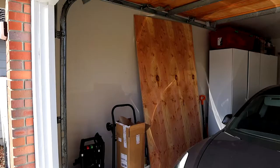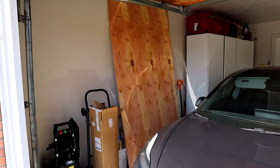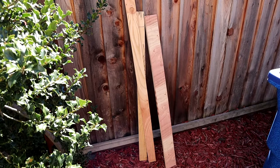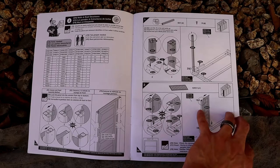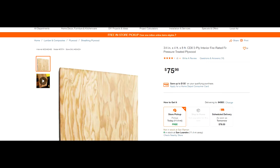This particular kit doesn't come with flooring, so you have to buy your own — really it's just a 4x8 piece of plywood. It would be more convenient if it came with it, but I can see why it doesn't since 4x8 is a huge piece of wood. Also keep in mind you do have to cut the plywood to fit inside, since the inside walking surface is smaller than the 4x8 outer perimeter. The instruction manual gives you measurements, but I'd recommend measuring your physical shed again before cutting. Duramax also recommends CDX plywood, which is designed for outdoor usage.